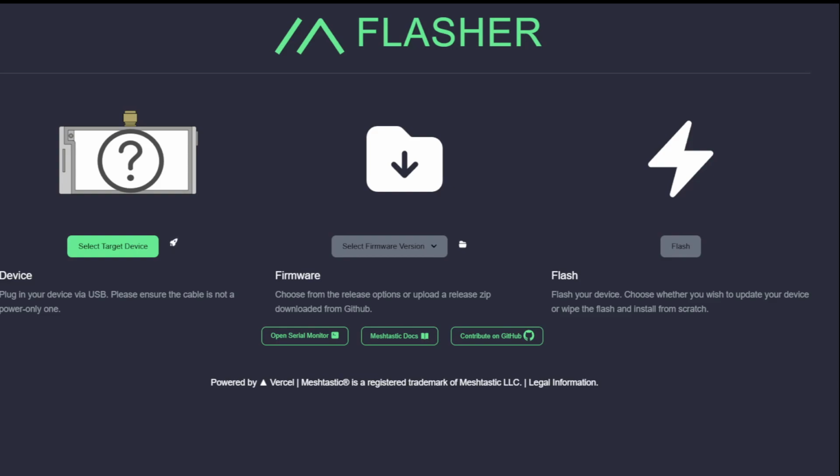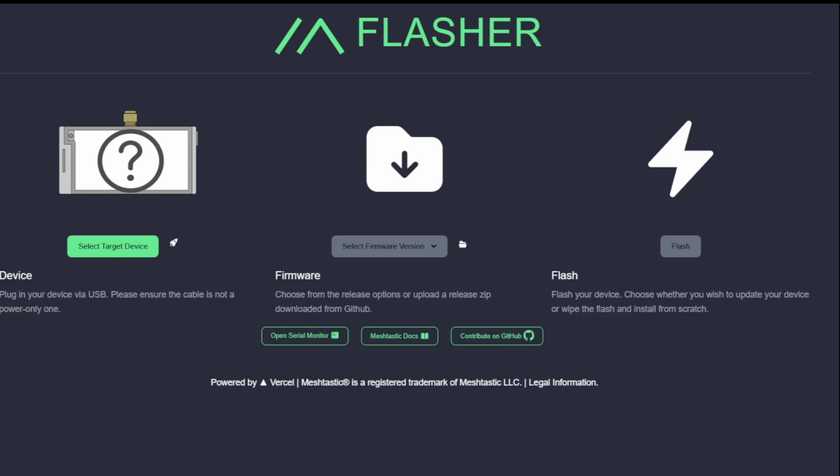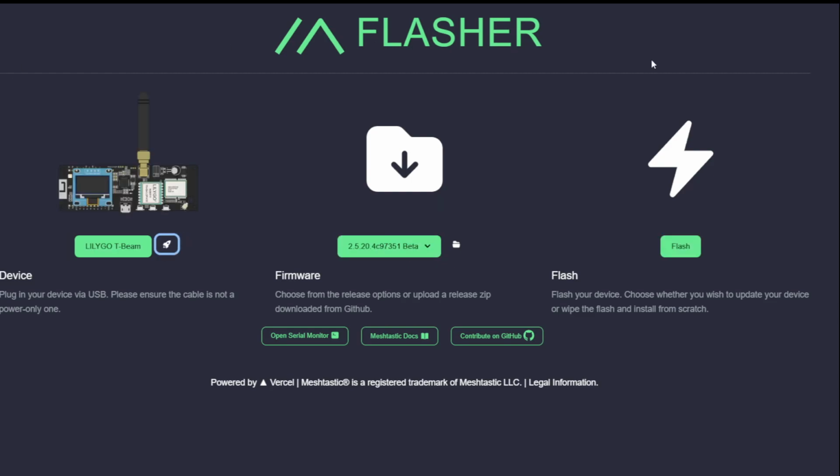Now, all we really have to do, provided our drivers are installed, is click the little rocket icon here, and it should automatically detect our device after we select a communication port. So as we click that, this little pop-up occurs and you see, hey, USB single serial COM 17. Your COM port will be different. Let's go ahead and select it and click connect. And look at that, it pops up Lilygo T-Beam. It's smart enough to know what it is.